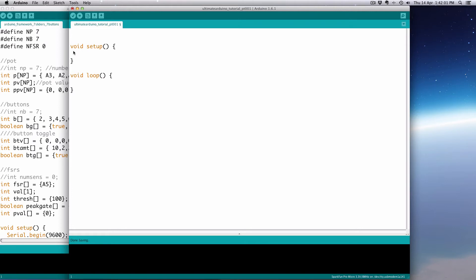Let's go ahead and define the pin. I'm going to make an int — we'll call it BP for button pin — and set it equal to 2, since my button is connected to digital input number 2. Then we're going to set up our serial bus, so we'll go Serial.begin with a baud rate of 9600 as the argument.